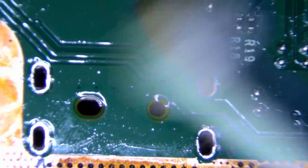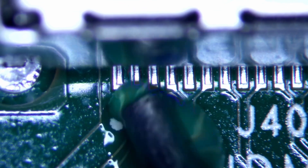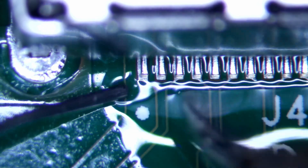We want to touch up the pads a little bit too and make sure they're going to be fine. You can see the new HDMI and the old HDMI connection — you can see the damage on the old one, but the new one looks very clean. We're going to go ahead and touch up all the pads on the back and make sure they're totally fine. It's just slotted in totally fine. We use some solder on each side and touch it up a little more. Now the most important part — you can see all these little trace lines here. We need to touch up each one to make sure they're absolutely perfect, because this is probably one of the harder parts of the job. You have to be absolutely pristine and precise because each one really matters and makes a difference — they all have a trace line to something.